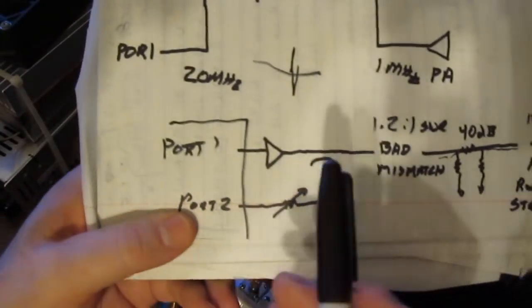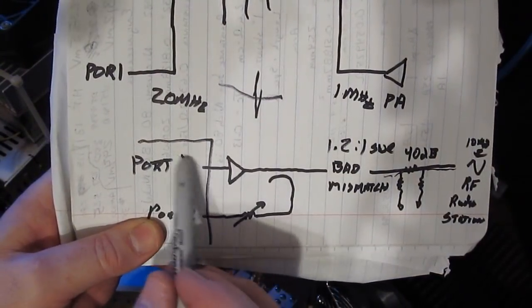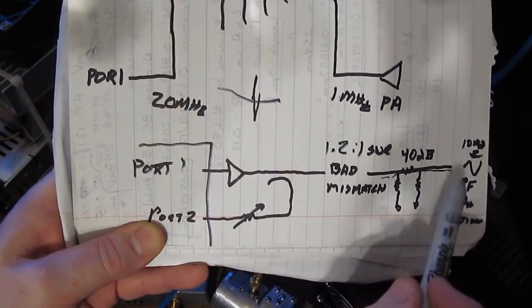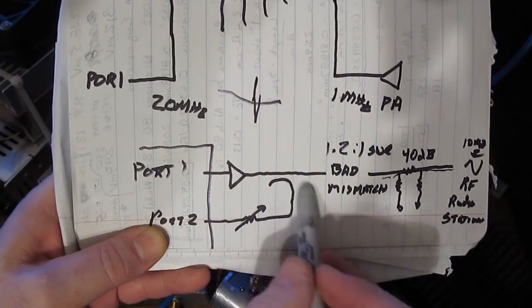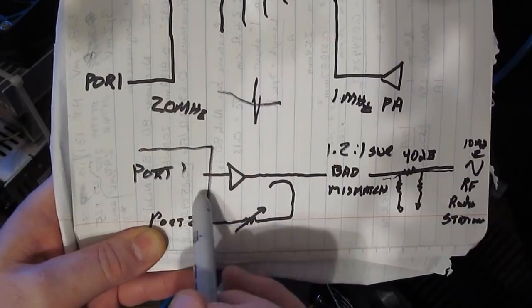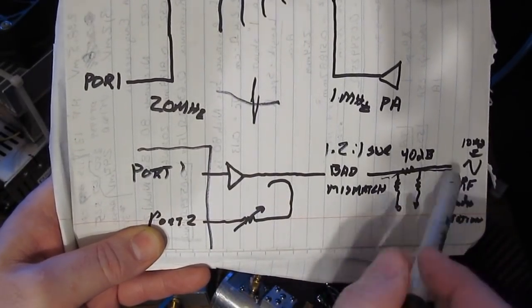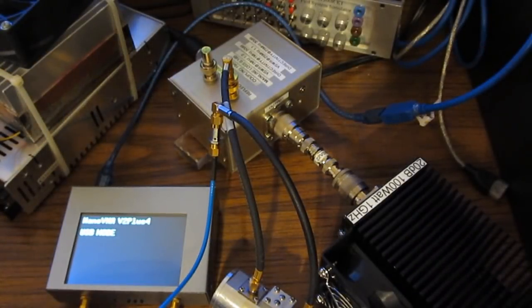I would imagine for most of you, this isn't really going to be much of a surprise. Obviously, if we have a low enough signal out here and a high enough signal over here, the signal to noise ratio will be quite poor. By introducing an amplifier and then looking at the reflected signal, we can raise the amount of power that's going into this side of our attenuator, and then we can overcome this signal. So just an interesting little experiment.